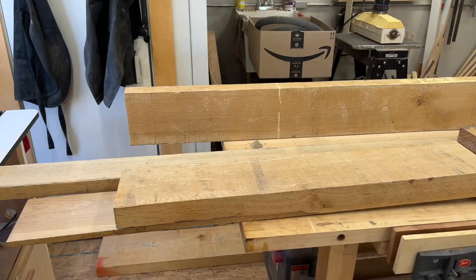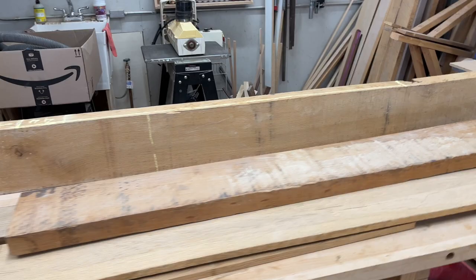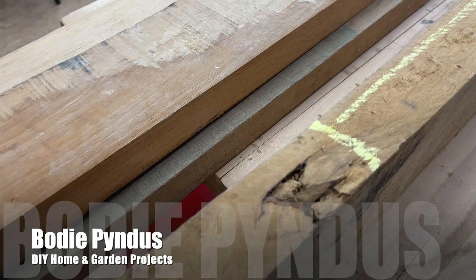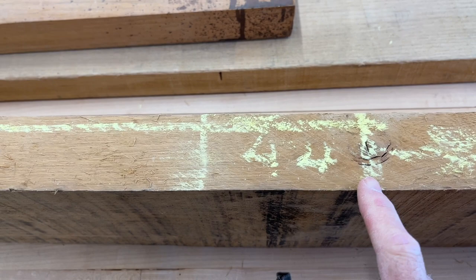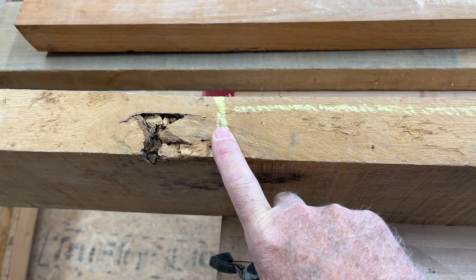Here's some of the oak lumber we're going to use for our next altar table. We have to get some for the apron. This piece is long enough, but we've got a big old knot right there, and we're going to try to work around it. We're going to rough cut this 44 inches down to just shy of that knot because our final piece is only going to be 40 inches long.